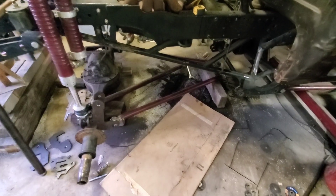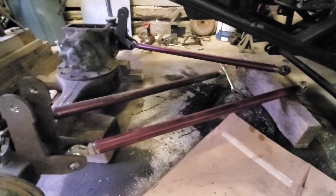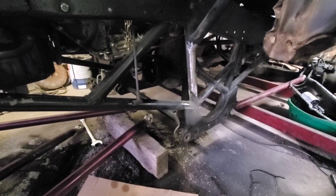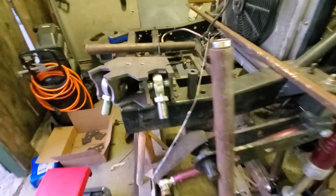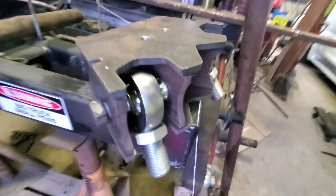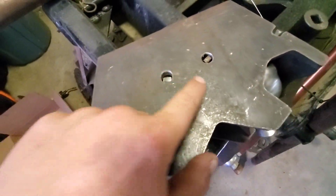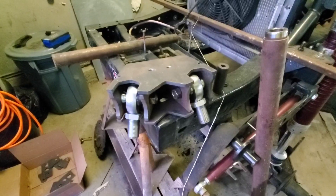To get this process started, I've got both axle brackets on and I've added the link bars toed in almost about 20 degrees. I also cut these cradle tabs off — still got to do the other side, but we'll get progress done on this side first. I have new brackets already mocked up and torched out at the corners so they fit the way I wanted. We'll get those tacked on. This bracket from Beyond Precise Fabrication is for the lower link mounts — everything ties in together. I just got to tack it all so we can put it on the chassis and see if our geometry is going to work out and our link bars are long enough.